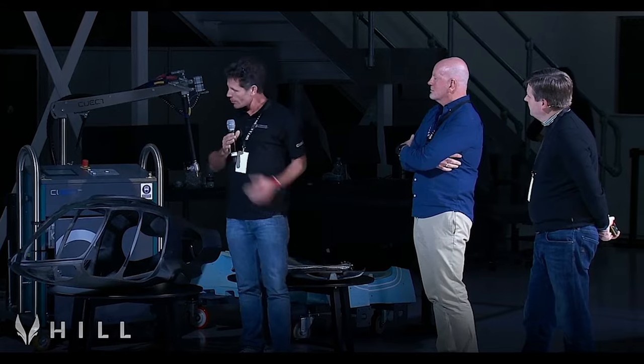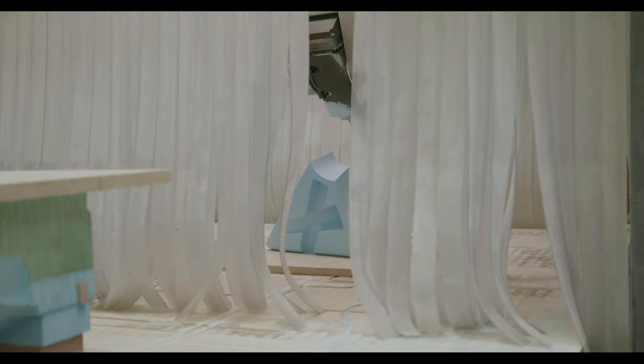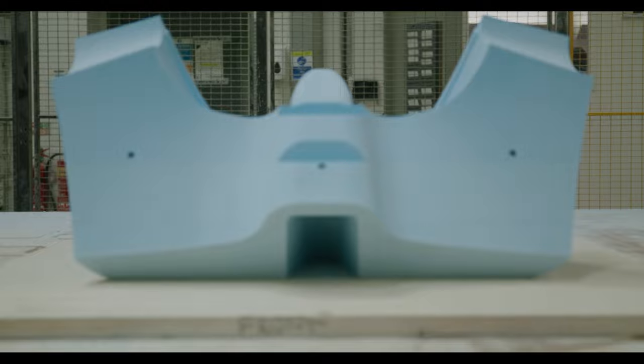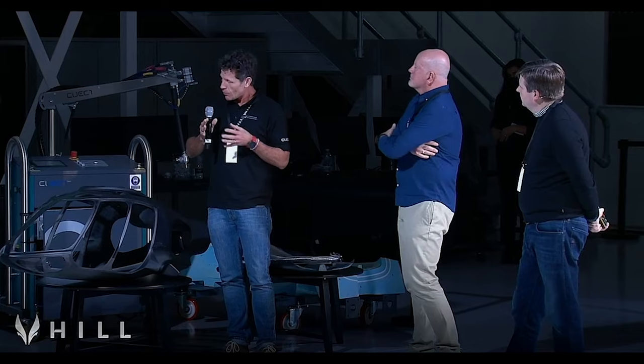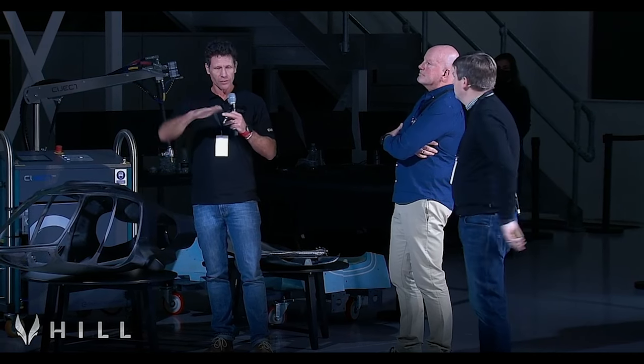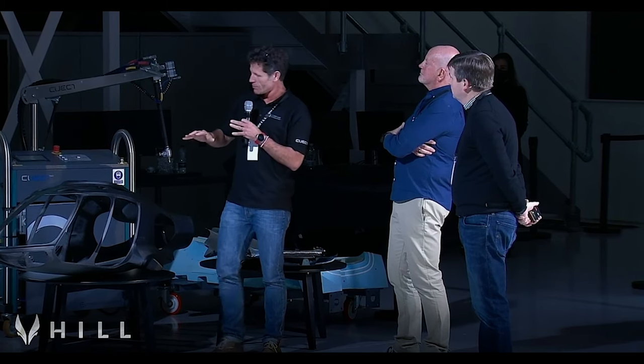I think that the key with this is really good preparation. Tooling is absolutely vital, and you can see the tools. Some of you have seen these earlier, but do come and have a look and prod them afterwards. We were really keen to take Tim's design and make a really good set of tools that we could mold off confidently. Now, the thing about this tooling system, there's six parts here. There's two sides, a top, a bottom, a nose piece which we couldn't fit in the van, which you've seen in the video.